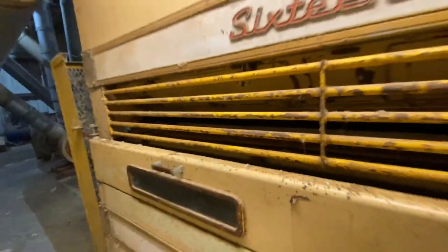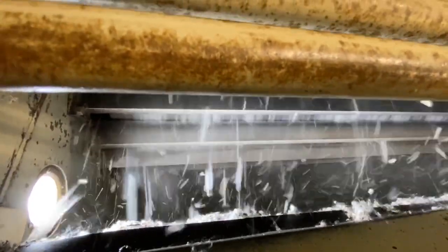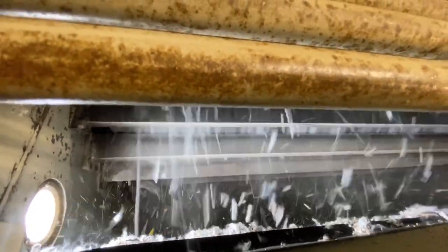You can tell a little more about it back here as the cotton travels a bit slower over a roller. Of course, there's still trash in it. There's air hitting the cotton, which is a lot of that little trash you see right there. Then there's two of the, or one on each gin stand. It's basically part of a gin stand. Each cleaner has to fit into the gin stand. Okay, so that's the little trash that's blown from the cotton. That is already seed removed.